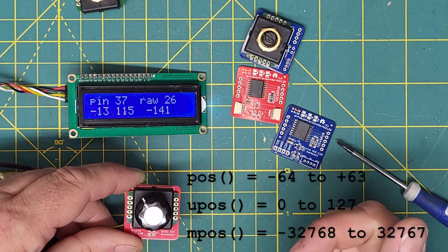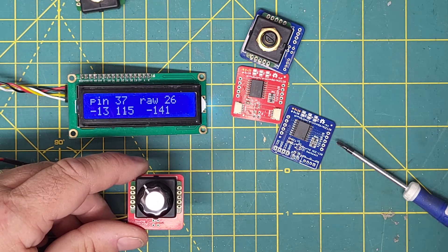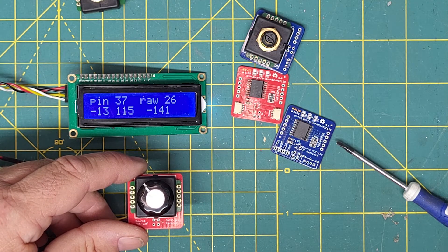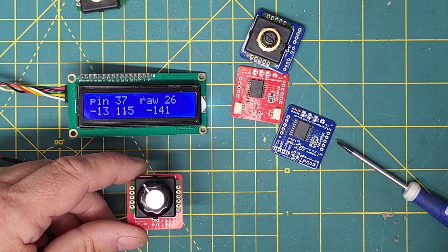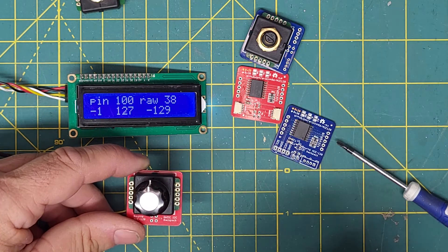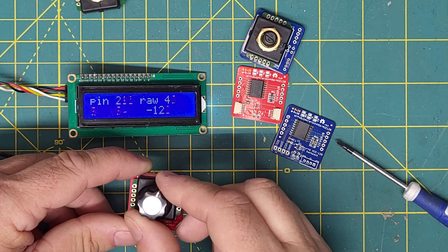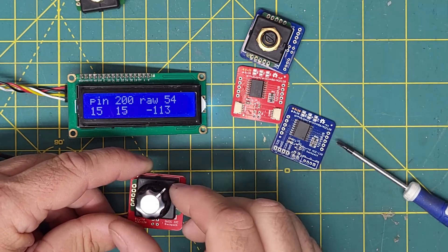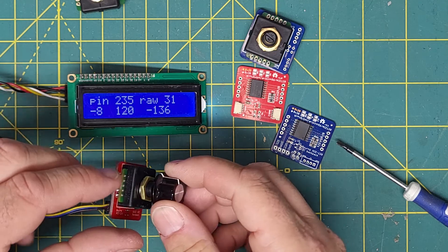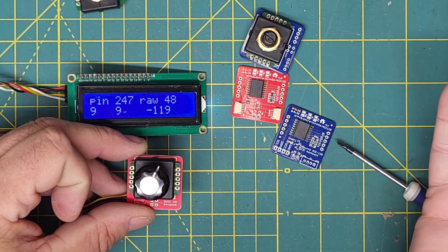You can use these in place of a potentiometer if you want a digital value and the ability to do multiple turns and know how far you've gone. Usually you'd use a potentiometer with an analog pin, or a regular rotary encoder if you just want something to turn freely. This has a more specialized application. The original application is my Dalek head — one encoder is mounted to my head and one to the motor that controls the Dalek head, so the head follows my head movement. Another is connected to a tilt sensor that controls the eye up and down, connected to wiper motors. You can use them for controlling servos and get absolute positions that match where you have it on your panel.